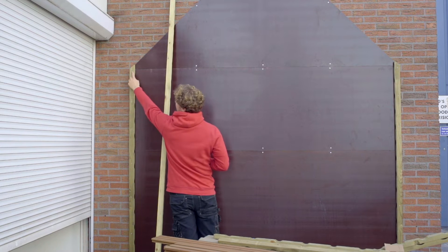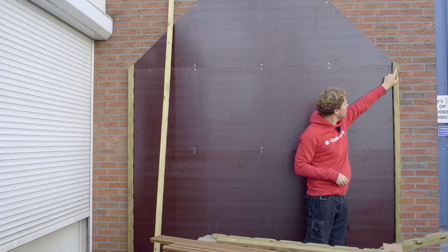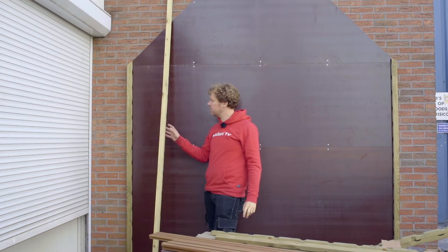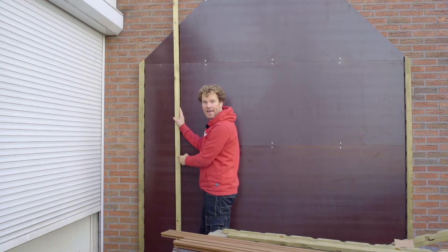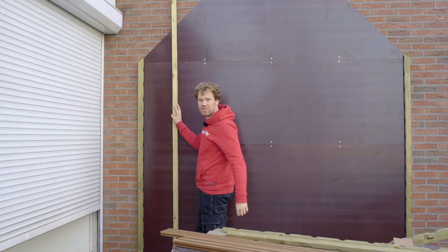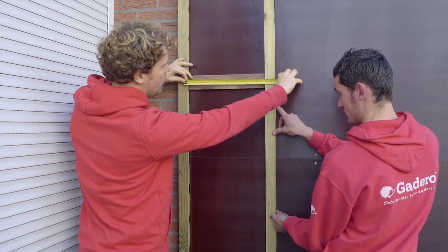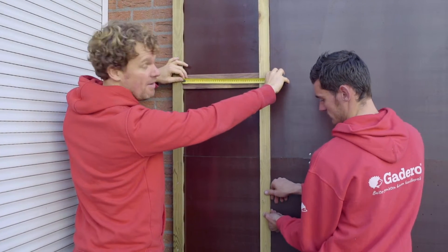To that end, we've measured from this center to the other, which is 2.46 meters. Divided by 6, that's 41 centimeters — so this is the distance that we'll be using. We'll use a small section of timber that fits the distance to help speed up the process. These smaller sections, that fit between the 41 centimeter center-to-center distance of the battens, are themselves 36.2 centimeters. They'll definitely come in handy for this job.